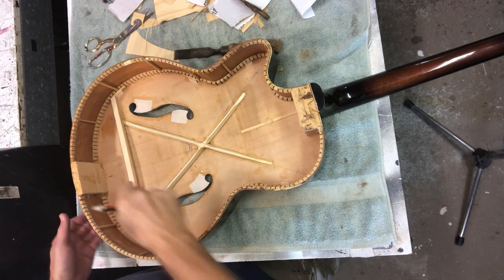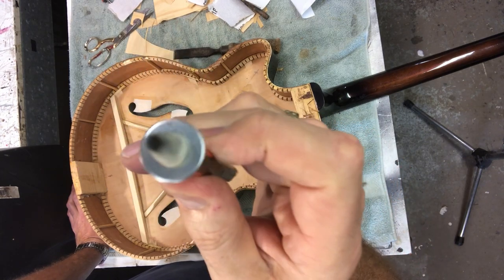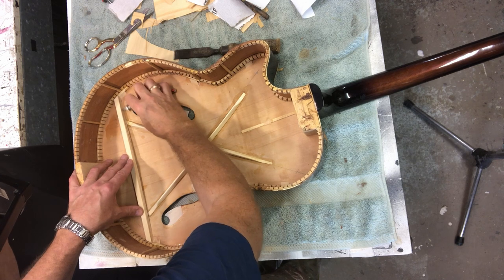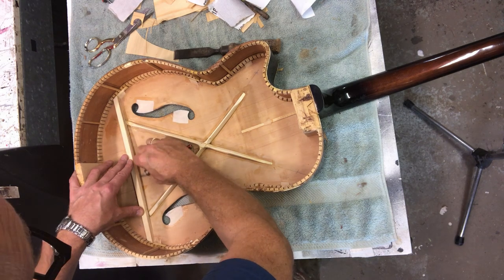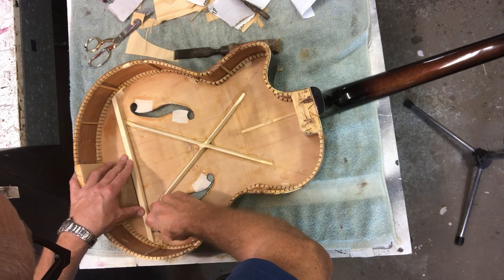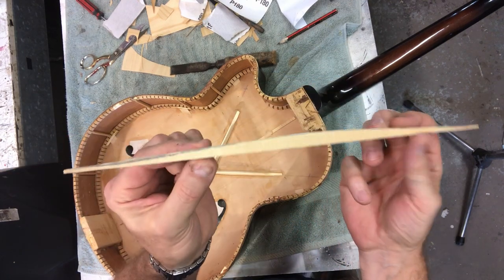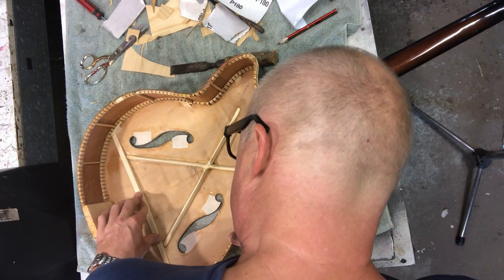I've cut the brace to fit across there. I've made up a little pencil with a washer on it just as a spacer. Laying the pencil pretty much flat with the top and making a mark — that's the washer just along the bottom there, and up on this side. You can see the pencil mark there. I'll just shape this down on the belt sander following the pencil line, and that's as close to a perfect fit as you could possibly imagine.